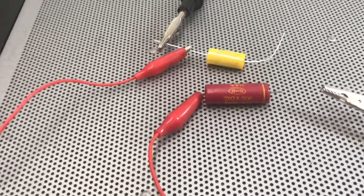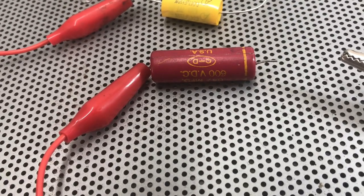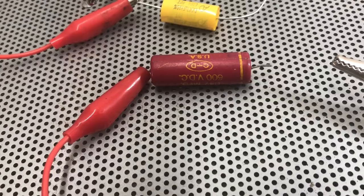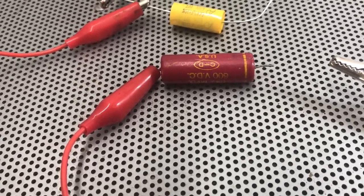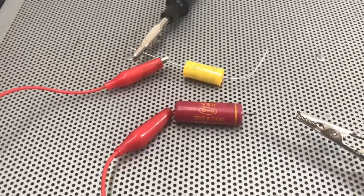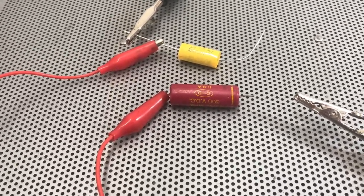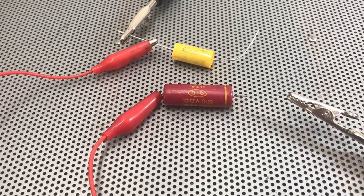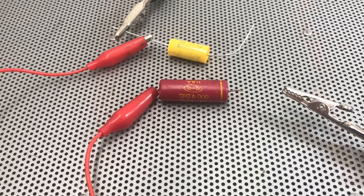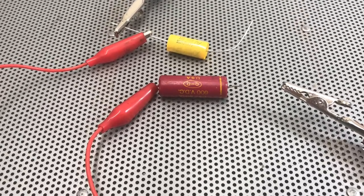The thing is just full of these Red Chief capacitors, and of course they're half a century old. A lot of you guys will check capacitors — I know I have — but I've had nothing to compare them to. And if you don't have a capacitor checker and you can't measure leakage, you just rely on an ohmmeter.